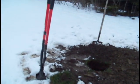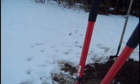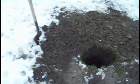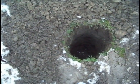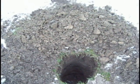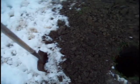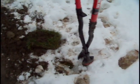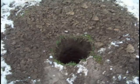The next step is to dig a hole approximately 50 centimeters by 50 centimeters and then 80 centimeters deep. You can make the hole bigger than that, but don't make it smaller. I just used a regular shovel to get to the side and then a post hole digger to dig out the hole, and it didn't take long, even in the winter here, to get through that.